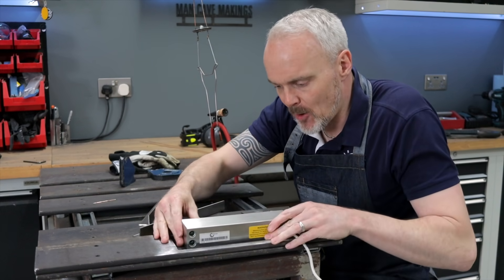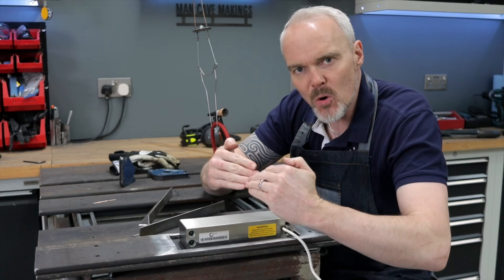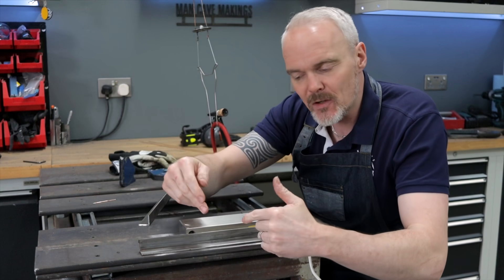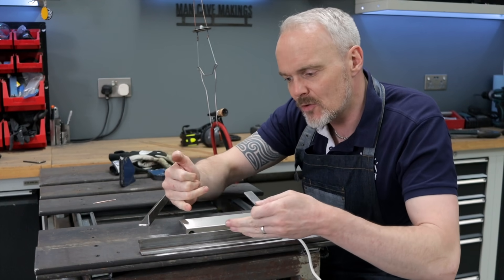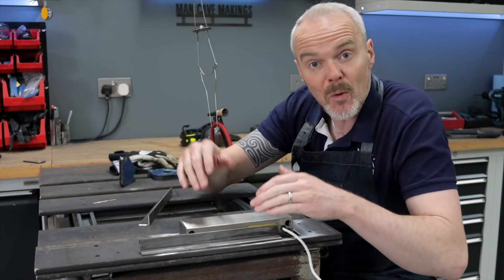It's a little bit thin and I want to make sure that if I bash anything on the top of this it doesn't bow or anything like that, so I'm going to use some little bits of angle iron here, just going to lay those in and stitch weld them in. I need to raise that up so I'm going to put a little tab in there and weld that, just to give me a bolt hole to go through and to secure the maglock to these brackets effectively. So that's what we're going to do next.